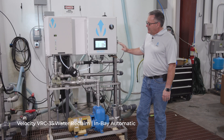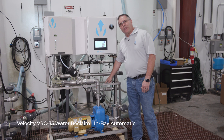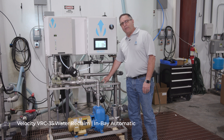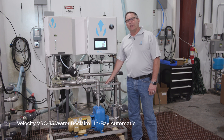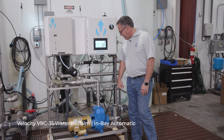The unit is air-operated — you've got an air-operated process valve and an air-operated fresh water bypass. A nice feature of the air operation is that the freshwater bypass valve is actually a normally open valve. So if you simply turn off the unit, it will automatically open without needing electricity — another feature you don't find in some other units that have a freshwater bypass.